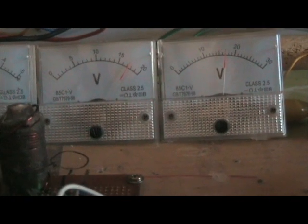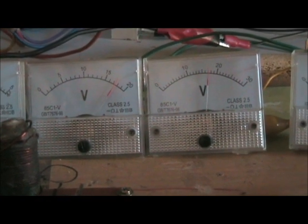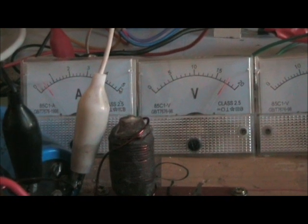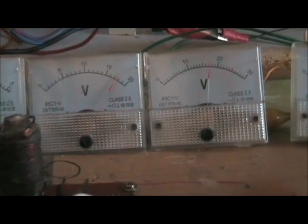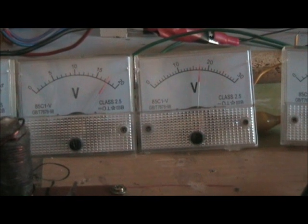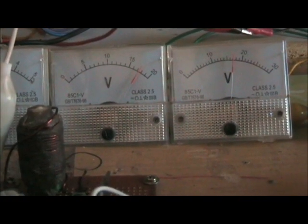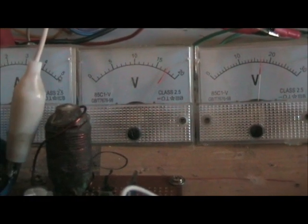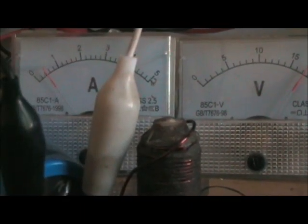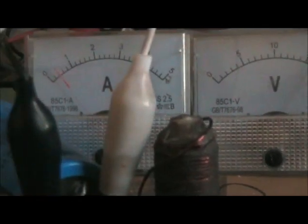This is the kind of action I've got happening now. It's not easy to see, but at that stage it's in the second highest duty stage. When it goes up that little bit, it clicks into the next higher duty stage, which attempts to pull the voltage back down. If it can pull it back down it goes back; if it can't, it stays up and keeps putting through the power.